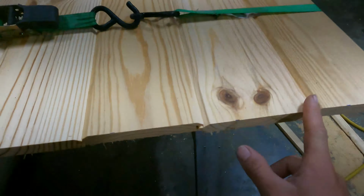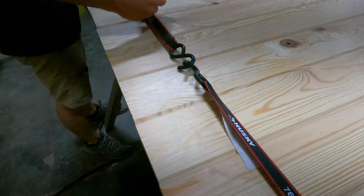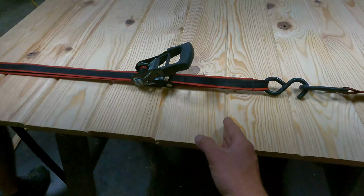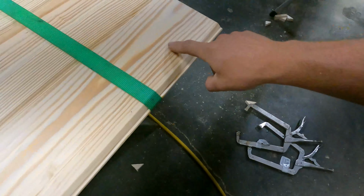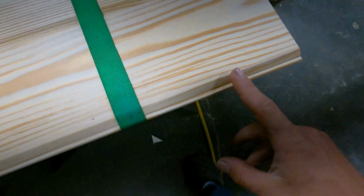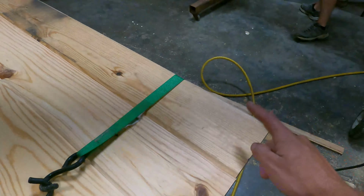We've got these straps on each side holding it together. That way we can get a center measurement off of this line and get 2 foot on each side, because our doors are 4 foot wide, so we need to cut the ends off right here to have straight ends, because we can't have this on the side of it. So we've got to figure out how much to rip off of each of these and get those cut, and then we can join them, put it all together, line it all up, and then start putting on these strapping boards.